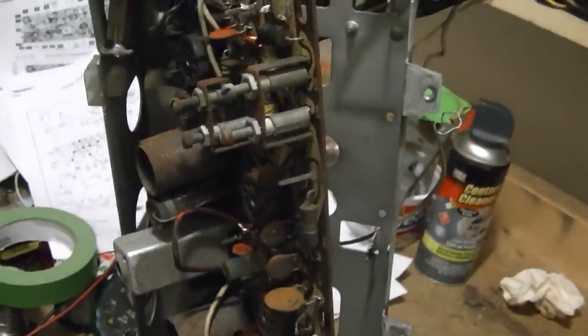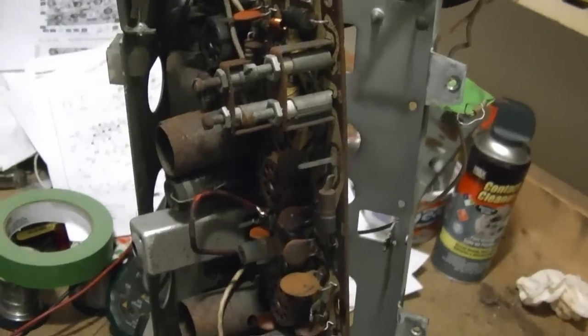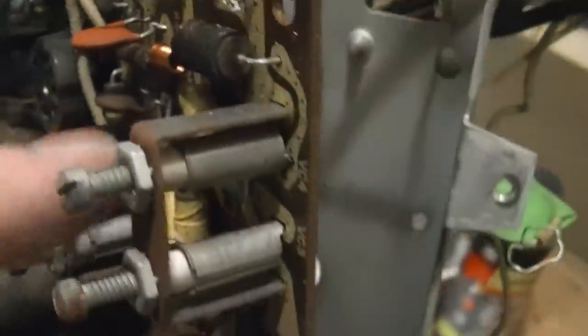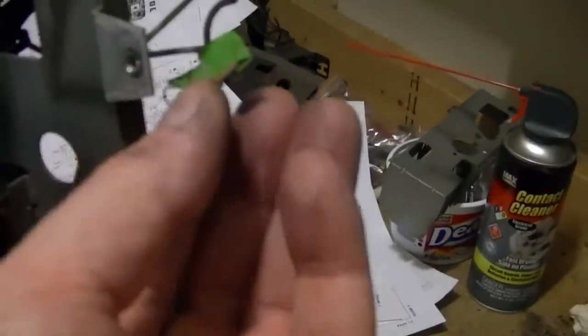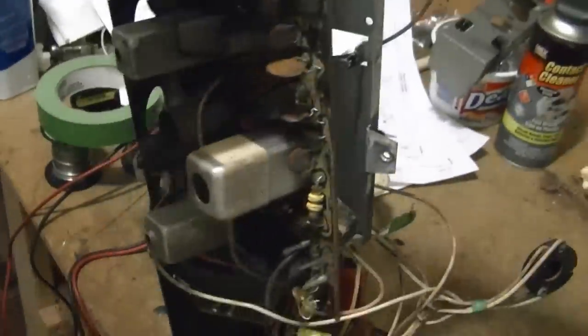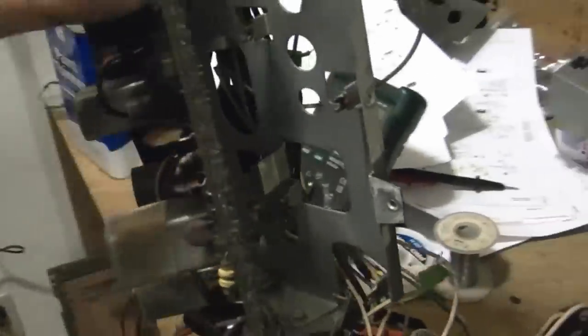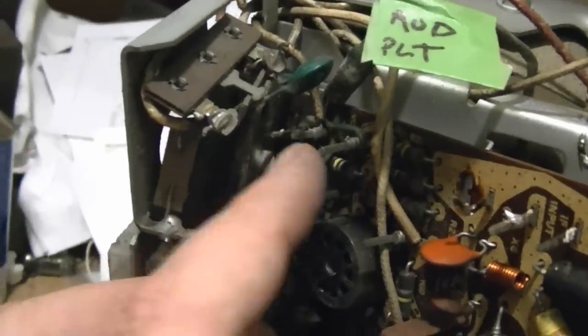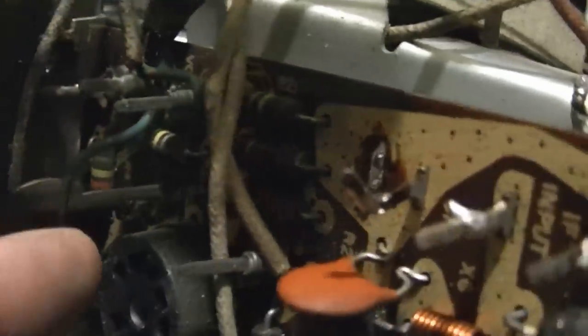For this board I did have to remove some of the wires, which would be good practice for the predictors I'm going to be working on. There are these square posts with wires wrapped around them - you can still see one here. The others I unraveled with a pair of needle nose pliers and put a label on each, as I have on several others. I can't quite fully get in there in some corners, and the wires up here are even trickier because there's some coax in there that's wrapped around and then soldered on.